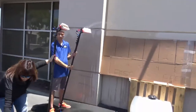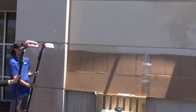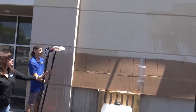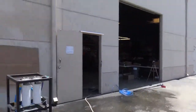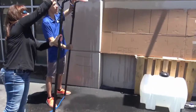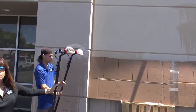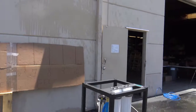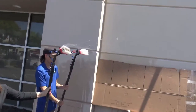Now with two water fed pole brushes, two pencil jets each, pulling off a buffer tank — shooting a good 20 feet. Turning on the rinse bars, I now have two poles with two pencil jets and rinse bars fully functional. The pencil jets are shooting a good nine feet still and the rinse bars are fully functional, all pulling from a buffer tank.